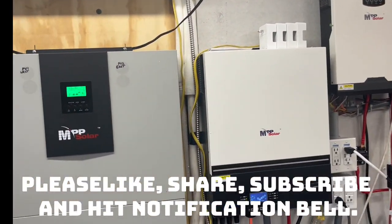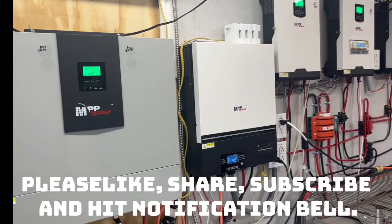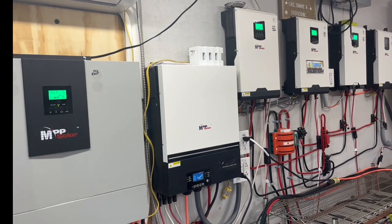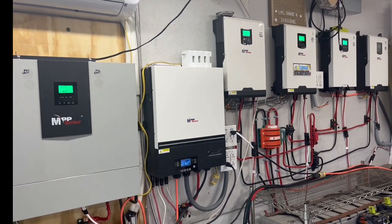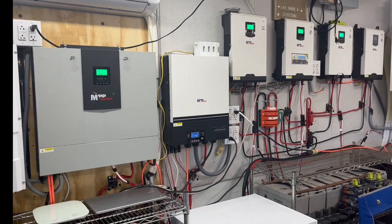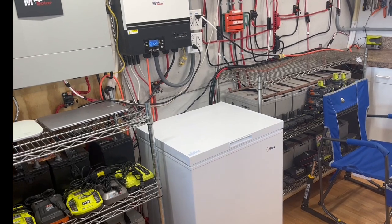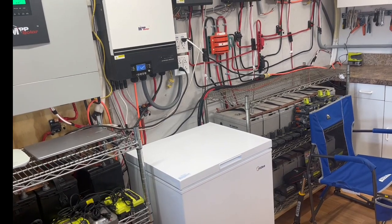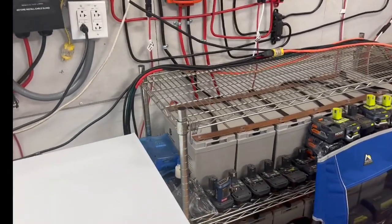My whole purpose was to reduce my bill. If I hadn't done anything two years ago, my bill would have been close to six thousand dollars. Now my electric grid bill is going to be between 800 and a thousand dollars, and all this equipment will last 10-15 years. The way I don't run these batteries down anywhere near 50 percent capacity - at 24 volts I keep them well above 25.1 to 25.2 when I get up in the morning.